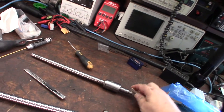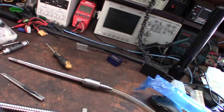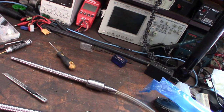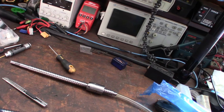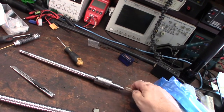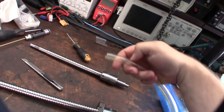The most important thing is you need to have something to support the balls, because if you just unscrew this thing, the little ball bearings will go everywhere and they're a nightmare to get back in. I've done it once before. You need something that's pretty close to the diameter of the big shaft — I'm using some clear tube here.